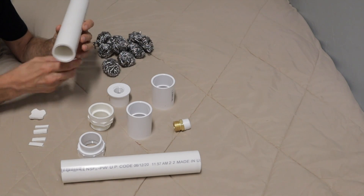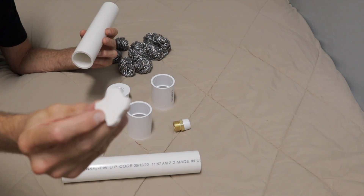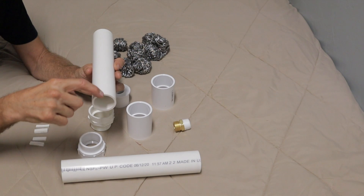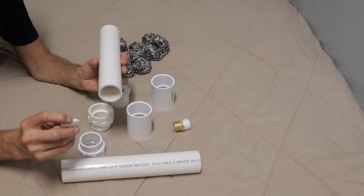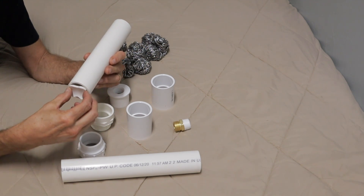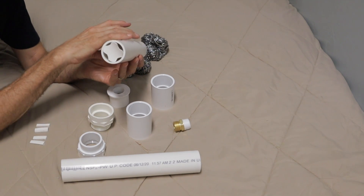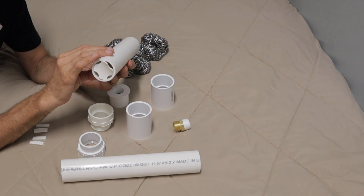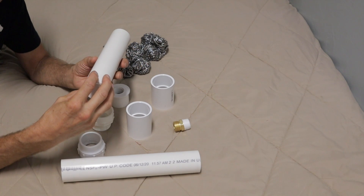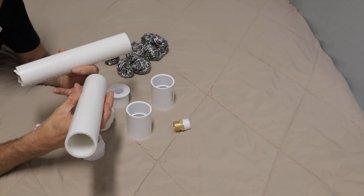The only thing you can't buy at the store is a little baffle I made — just a small piece of curved inch and a half pipe. I took a piece of this pipe, sliced off a section, cut out a little square of it, then put relief cuts on all four corners. I rounded it with my sander so that it's a tight fit into the end of the pipe. This baffle will stop the flow as the foam comes down through the stainless pot scrubbers and force it out through four holes instead of roaring straight out the end at really high velocity. This should slow it down, and then it'll come out into the larger pipe and expand before exiting.